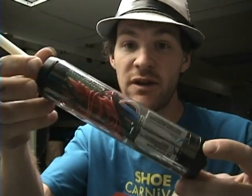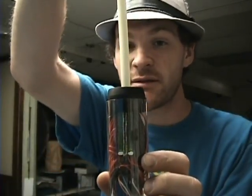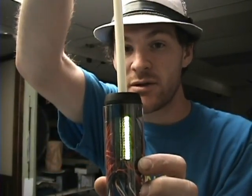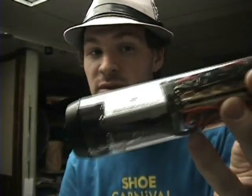In this video I'm going to show you the full process. Here's the finished product — it looks like a mess, it was designed as a mess, but a functional mess. On-off button down here, it runs off two 9-volts, it's got a 12-volt regulator in it, and a hall sensor chip on the end. I can detect how strong the magnetic field is, detect north or south, and use it as a gauss meter to an extent.